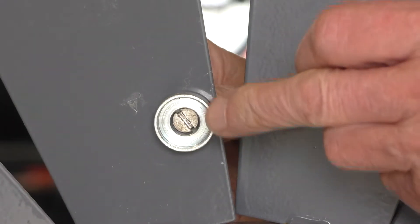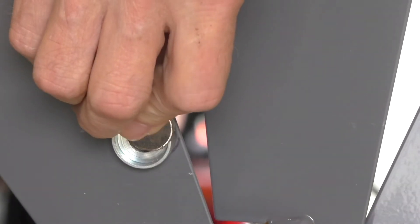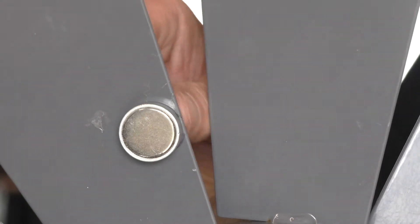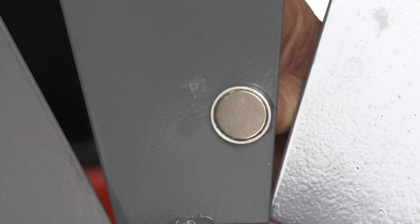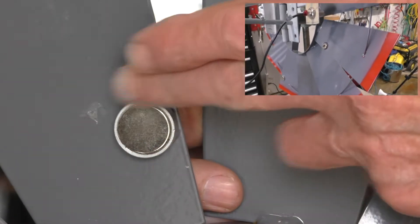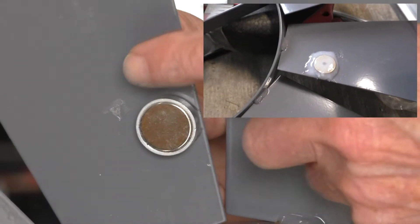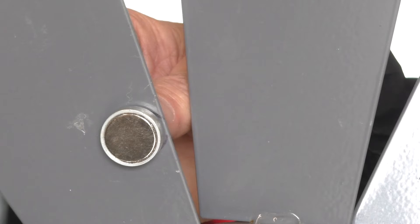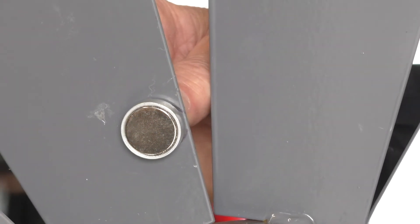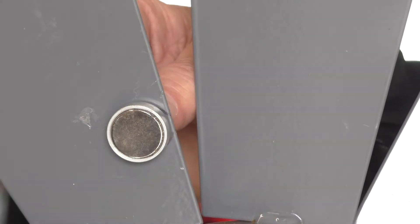So this is a magnet cup for this magnet right here. I have to ensure I get the right polarity for the Hall effect sensor. I'll give it a try in one direction; if that doesn't work, I'll switch it around. Previously I tried just a magnet on the steel — the magnet flew off. Second try I epoxied the magnet on the blade of the rotor and it also flew off under operation. So in this particular try, I think the bolted-on magnet cup should do the trick.